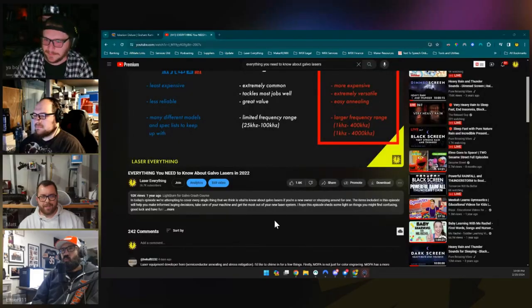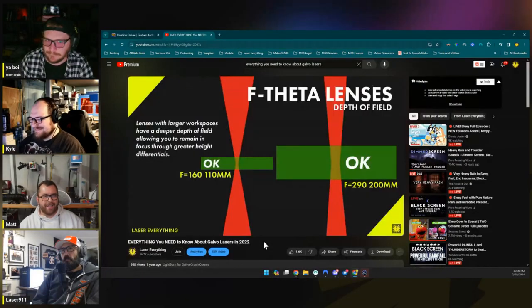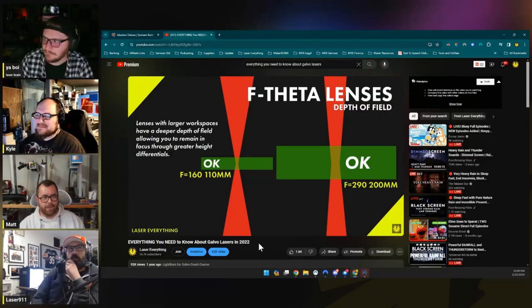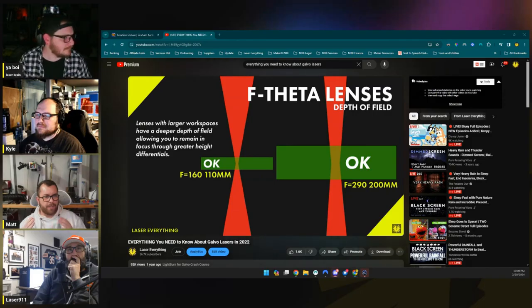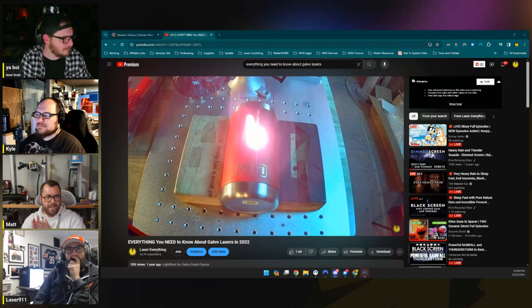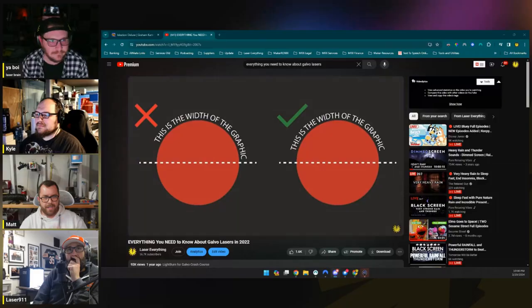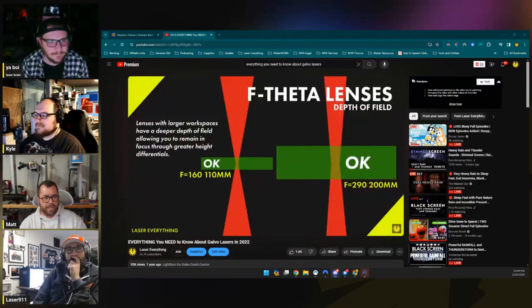And by the way, this is where Ed said you already answered the UV question before, and he's kind of laughing about it. The one thing I'll tell you though, UV is one of those things where if you play with fiber first and you learn about frequency and you learn about power and speed, you can really take those skills and knowledge and transfer them to the UV laser, because it's Galvo based. And I feel like once you practice and take time to burn some stuff, you've learned enough that you're able to figure some stuff out pretty quick. You really can be successful with it. So don't shy away from something, because it's a super, super useful tool in the shop.